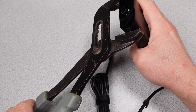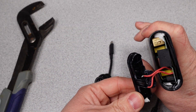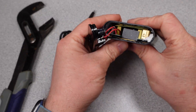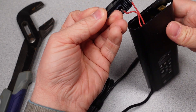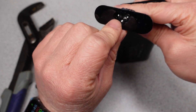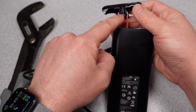The adapter is going to crack open with giant pliers. The end popped right off and right away I see something I don't like. The adapter has a 3 pin connector and apparently an earthed power connector. What I see here is that there is not even a wire to the earth pin, so this should only have a 2 pin power cable. The benefit to building this adapter is that it would be cheaper to manufacture to supply a 2 pin power cable and a smaller connector, so this is a waste of materials and money as a first pass.